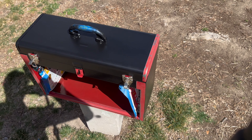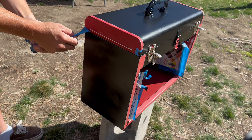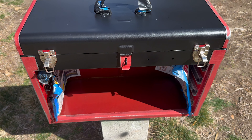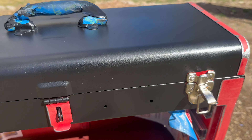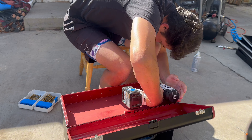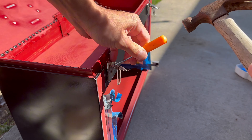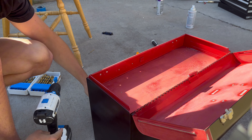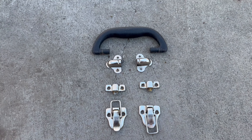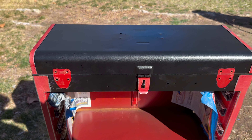You can kind of get an idea of what it looks like. I forgot to peel this whole side. This hardware being red kind of bothers me. What I really should have done is drilled out the rivets and then re-riveted it, but that's a lot of work. You know what, this is actually really bothering me, so I think we're going to do it the right way — take all the latches off, take the handle off, and then learn how to re-rivet. After a bit of a learning curve, we've got all the hardware out. Really wish I would have just done that in the first place — it would have saved me so much time taping. That is what I call making a U-turn in stupidville.